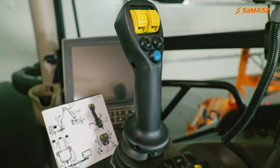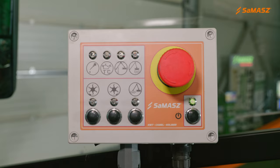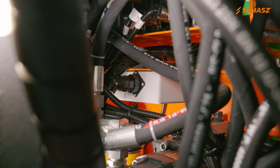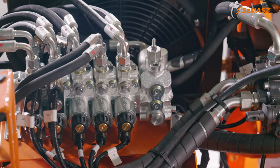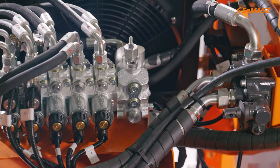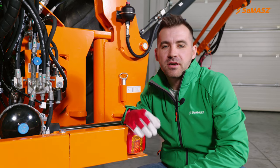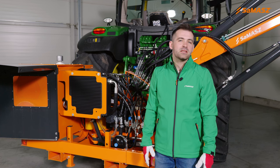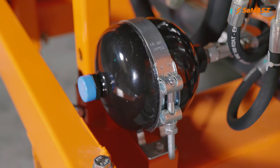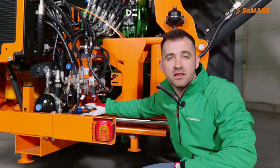This type of control system is mounted on this particular machine. In this version, we operate the machine with a joystick and a panel located in the tractor's cab, together with a control unit and hydraulic distributors on the machine. If a control system failure occurs, it is possible to manually override the hydraulic distributor, which makes it possible to mechanically fold the machine arm and deliver it folded to a service station. What we see here is an overflow valve, which works as overrun protection for the arm. The machine hydraulic system also includes hydraulic brakes and a hydraulic gas accumulator, which are responsible for the smooth operation of hydraulic cylinders.